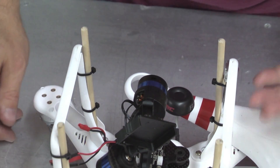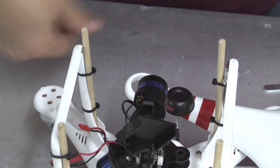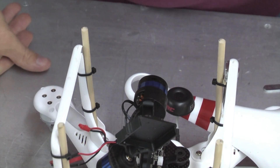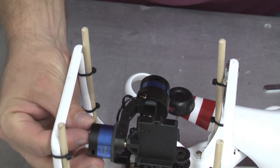The main reason for having a JST separation rather than hardwiring it is: when you fire up your Phantom, you want to allow it to obtain satellites and steady the IMU without drawing extra power. Once the Phantom has a connection and is ready to fly, I simply plug in the Tarot, wait about 6 seconds, it comes alive and steadies itself, and now I'm ready to fly.